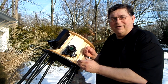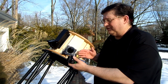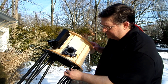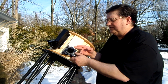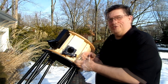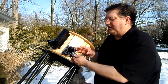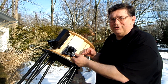Sure enough, just when it hit the stop, I was just slightly out of focus still — the big TeleVue 22 would not come to focus. So what I had to do was disassemble the telescope and chop just a little tiny bit off each of the four poles — actually about a half an inch. To determine how much to cut, I racked it all the way in, then racked it out to where I wanted it to focus, and measured that distance. That became how much I took off the poles.